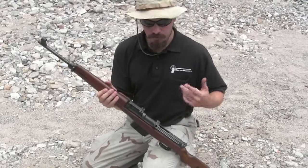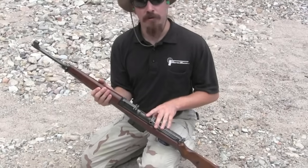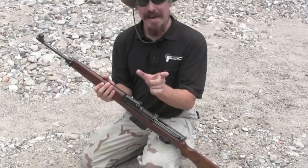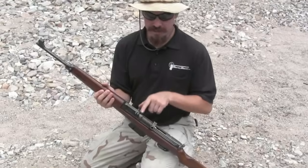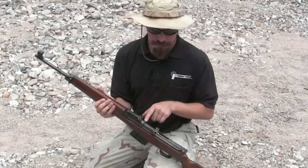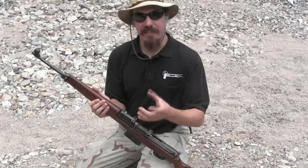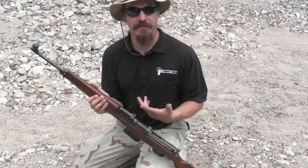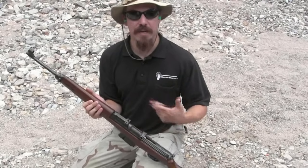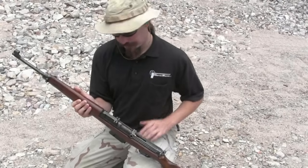Anyway, the bolt system that Walther developed for that rifle used this pair of matching locking flaps. The piston came back. It's a short stroke gas piston under the handguard. It came back and knocks the bolt carrier backwards. The two flaps, which are kind of like a miniaturized version of a DP or an RPD machine gun, come in, and then the whole thing cycles backwards.